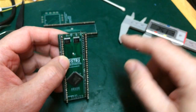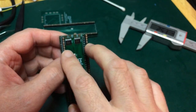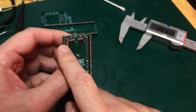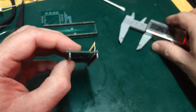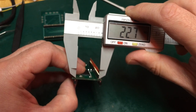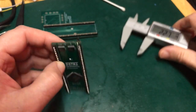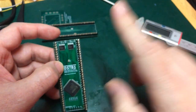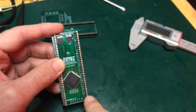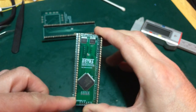It turns out that I have placed the offset socket headers, if you like. I have placed them 1/10 of an inch apart. They're 1/10 of an inch offset from the other ones. So it turns out that actually my two narrow rows of pins are the right pitch. And down this side, every single one of these pins is connected to every single one of these pins. There's a one-to-one mapping. There's not been split out via the CPLD, which does happen down this side.